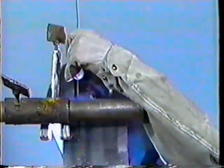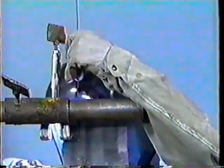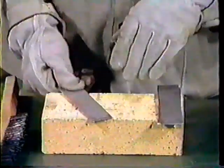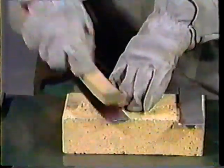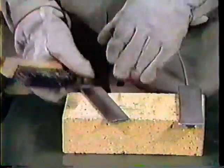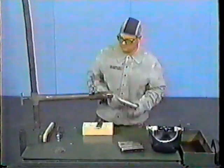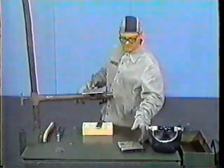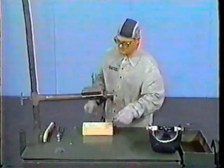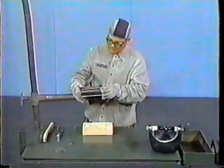For the next demonstration, our welder will weld the T-joint in the vertical position. Contact your instructor before you start to weld. It is important to ensure that the metal being welded on the flat side and the edge to be welded are thoroughly cleaned using a wire brush or a piece of sandpaper. After they have been thoroughly cleaned, position and align on a backing plate two 1/8 by 1 and 1/2 by 6-inch stainless steel coupons, as shown here with a 90-degree angle.